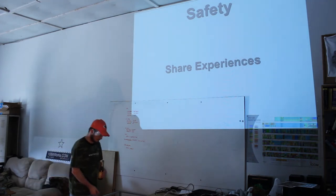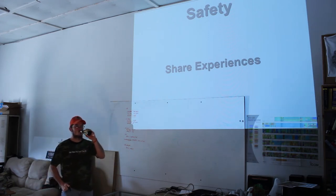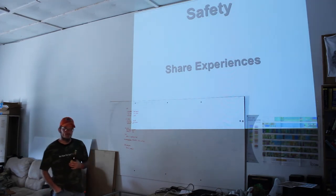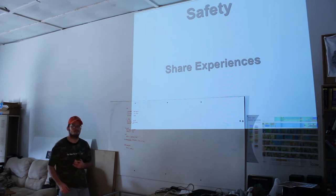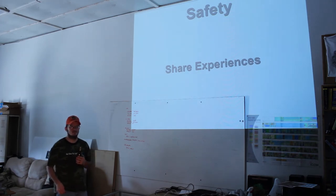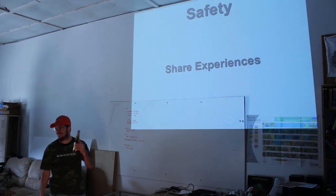I was talking to my friend, and she was a professional welder for a number of years. On the shoes, she said that's the most overlooked thing. She recommended boots, and shoes that don't have laces, because the laces will catch the slag and you can't kick the slag off. So it'll end up burning your foot. She recommended a denim work shirt. And she also said when you catch fire, don't panic. Just pat it out. That's another thing: it's not an if, but when.